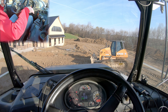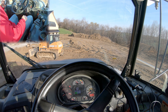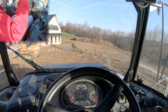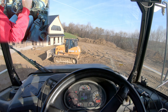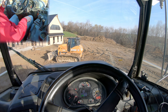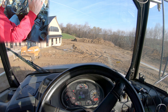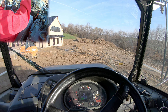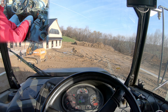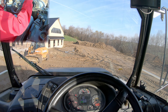You do want to get to a point where you can clip around pretty good — that is why we do the fancy foot maneuver. If I sit and idle it's going to take forever to get that box up, but if we peg the RPM and jam it up, it'll get there super quick. Just make sure as you get towards the top of the cylinders you're not slamming the box open — feather it. Ideally you'll know when you're 99% of the way up and let off the lever. In real time it's very quick: throw it, drive, hit the gas, and as you're pulling away hit the lever, because that 10 feet happens fast when you're really on the gas.